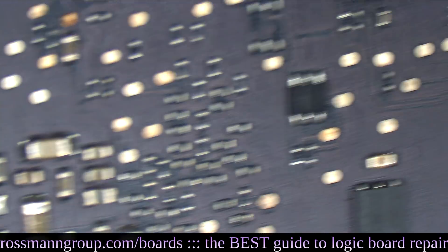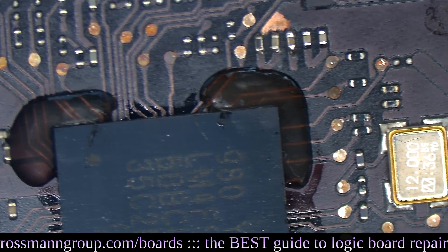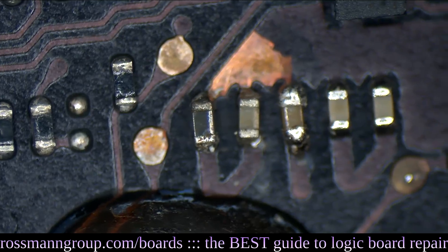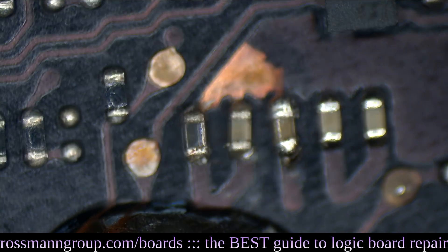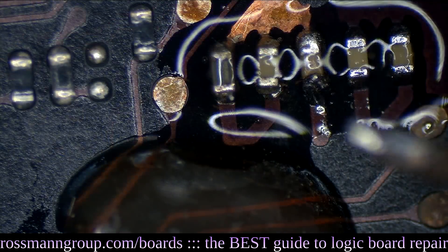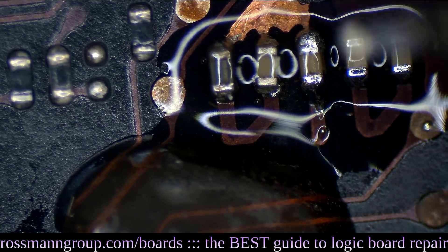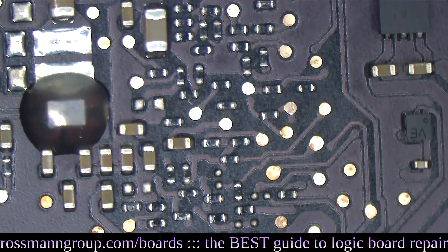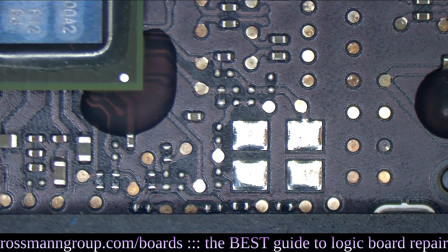So this one can get dumped in the ultrasonic cleaner, and then I'll show you what it looks like at the end. Once all the ball hair has been removed from the board, it's going to look amazing. Now we can check out what the board looks like after it's left the Crest ultrasonic cleaner. And as you can see, it's looking pretty nice. I'm going to zoom in on the caps right over here where all that nasty junk was — and as you can see, all of it's been removed. If I just add a little bit of flux and touch it up with the Hakko FM-2032 iron, link in the description below, it'll look just perfect. And if I zoom out and look over the rest of the board, all the evidence of that janky-looking nasty ball hair has been removed.